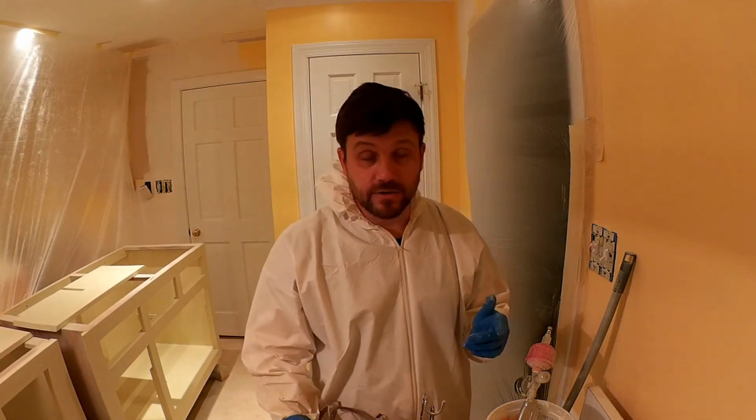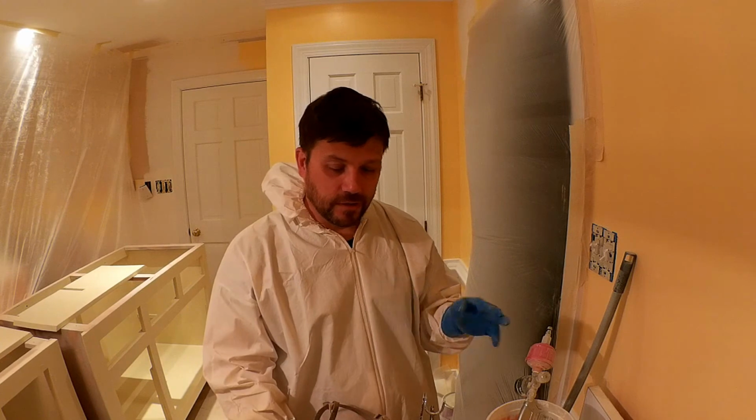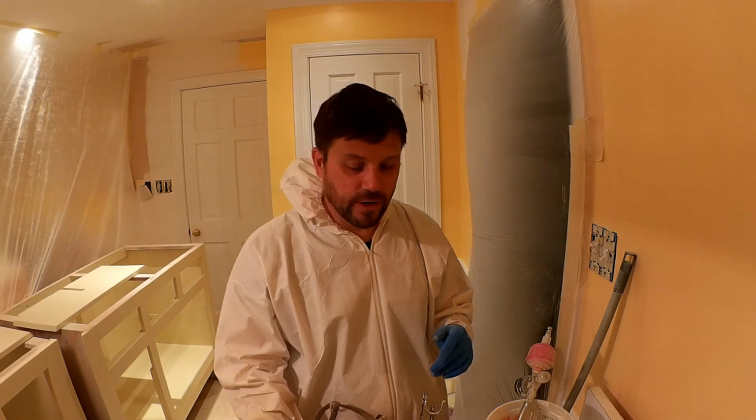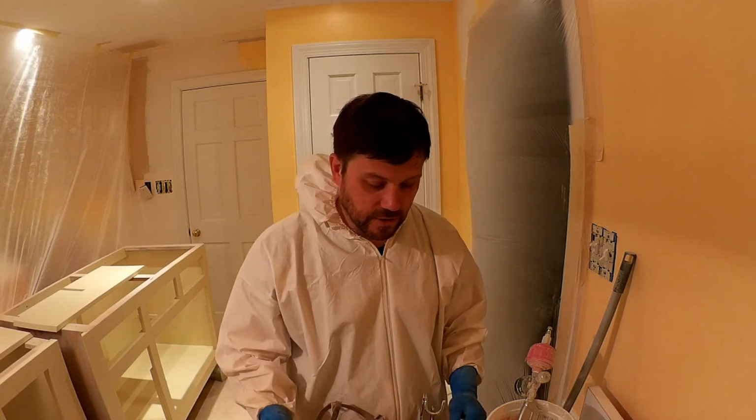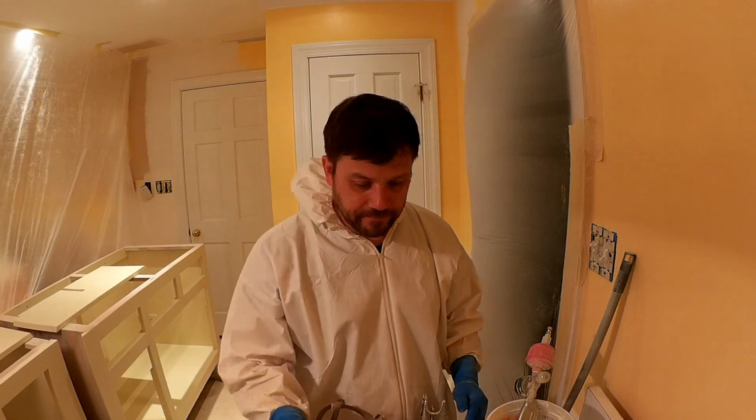And then when I'm ready to start the next time, all I do is get a little automotive brake cleaner and I'll just spray it through those holes to clean all that WD-40 out before I'm ready to use it, and then it'll be all nice and clean and dry, and there aren't any contaminants in there, and it's not going to rust. So that's how I do it.